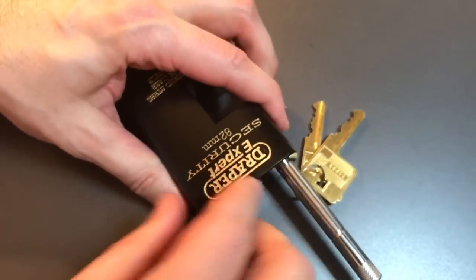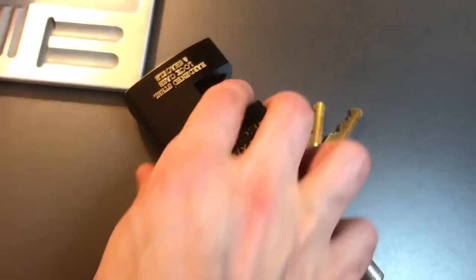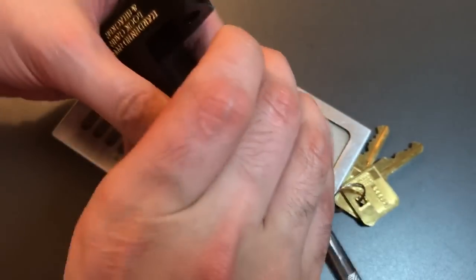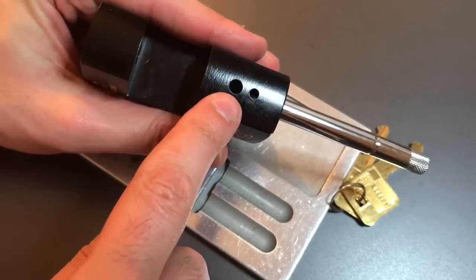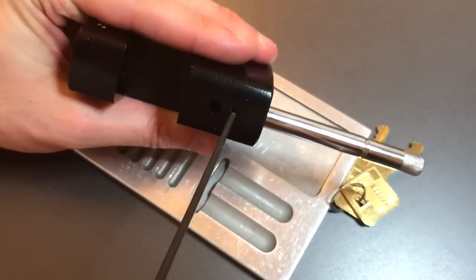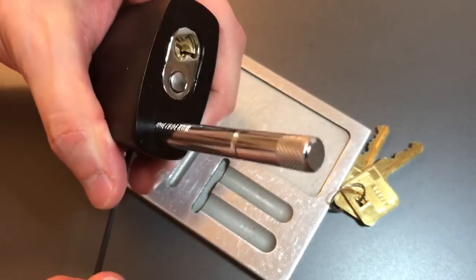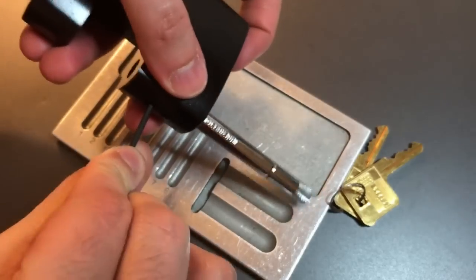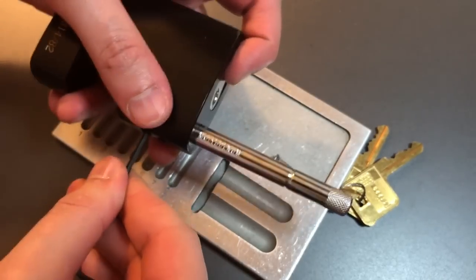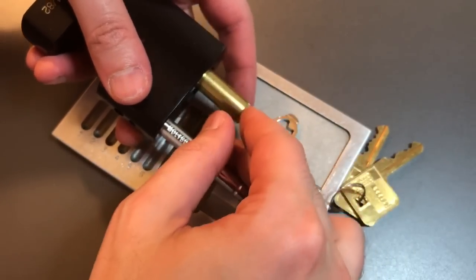The lock's open. Let's take this lock apart and we will see what's inside. To get this lock apart, there is an Allen screw that's right down this hole right there, and you don't have to take it completely out. You just have to loosen it a bit until the retainer plate and security nut come out.